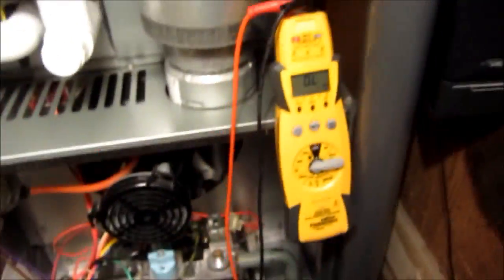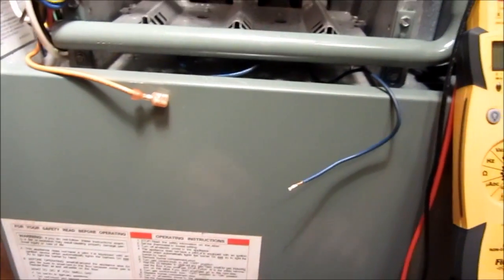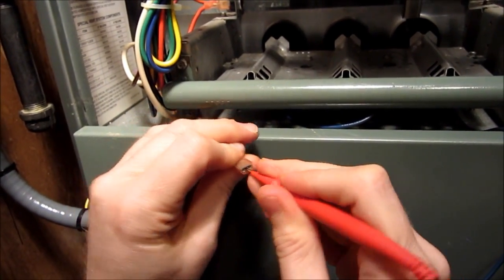Alright, we're going to move on and test the flame sensor. We just got done testing Ray's igniter on his RTPH 1997 model — look how beautiful the furnace looks, it's pristine. On the Rheem with the Norton 201 that's going to be a different ohm rating. Now we're going to look right underneath the main gas manifold — it's only about an inch or two to get to the flame sensor. What Ray has done is run a wire in there with a female-to-male side so we can put this in series and test the flame sensor. We should be within 2.0 to 4.0 microamps per the manual.